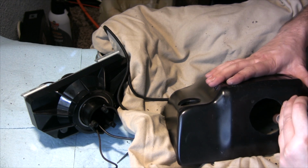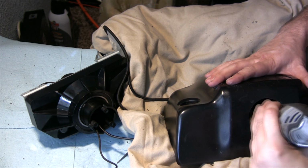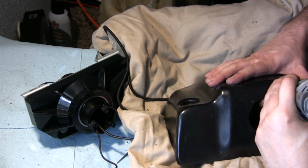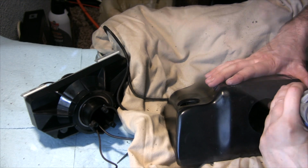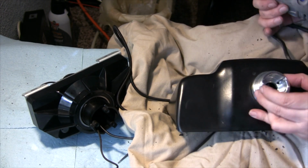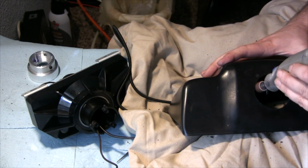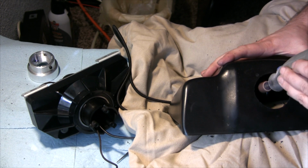Right, because after you solder it, you can't just take this plug out and remove this coupler if you need to work on this again. Or to even get this case back on, because you soldered all this together, you have to open that hole to allow that coupler to slide. If you didn't solder it together and used the connectors, you'd just be able to unplug the connectors, unscrew this, and pull it off.